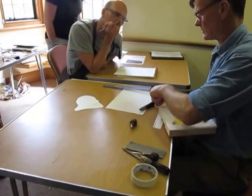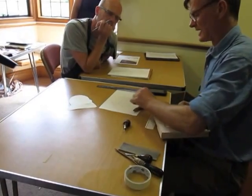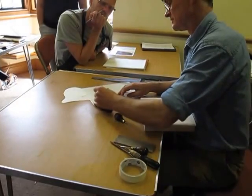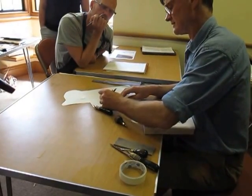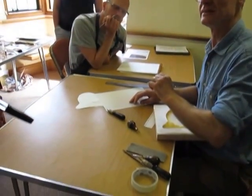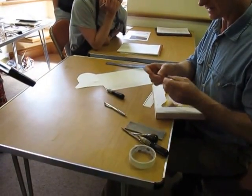When you sharpen, you want to make sure that it's at right angles. If you sharpen it like that, as it were, when you're trying to cut in, that's your gold, that's your board, and it's to say you want to cut off to there. If you've got your chisel like that, you won't be able to cut accurately there, so you want a nice right angle to cut exactly on that edge. So when you're sharpening, don't get all lazy and go like that. You'll make a curved end. You want to have a really perfect right angle.